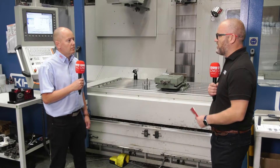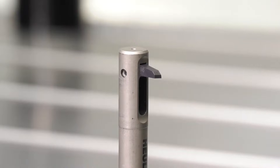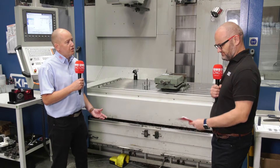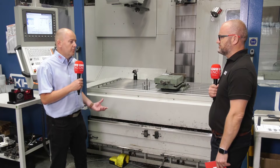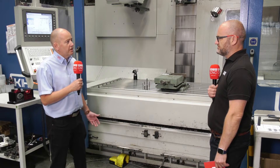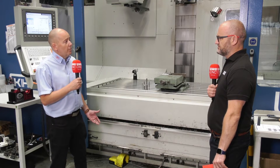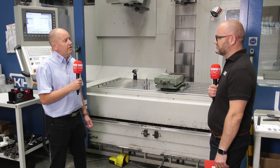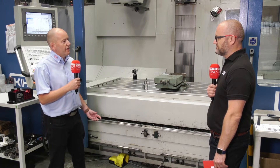One of the biggest factors driving this tool is health and safety, because a lot of the older tools required opening the machine doors and attaching another cutter to do the back feature. The BSF means you don't have to turn the workpiece over, ruling out additional operations — it does exactly what it says on the tin: back spot facing from the top using through-coolant.